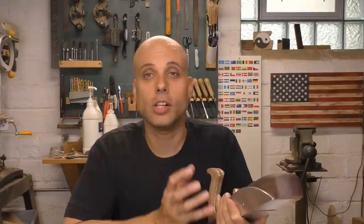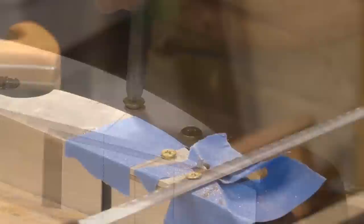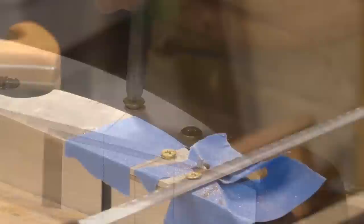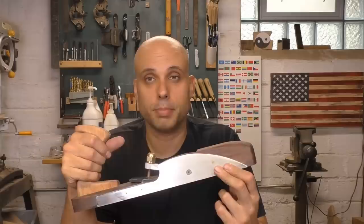The finished product does look really good. Just because this is a workhorse tool doesn't mean it needs to look like one. But what it's time to do now is test it. As soon as I went to test it out, I couldn't — because this glue joint right here had just popped right open. If you're counting on epoxy to hold together a tool like this, you're going to be disappointed. It needs some sort of mechanical interlock. So I went to Home Depot, grabbed some brass screws, drilled through the sides into the body, and added a light countersink to each hole. Then I ran the screws in until they filled up the countersink, sawed off the heads, filed everything flush, and then relapped and polished the sides of the plane. You still end up with a little bit of the screw head in that countersink, and that's enough to hold everything together really well, while the sleek look doesn't mess up the aesthetics.